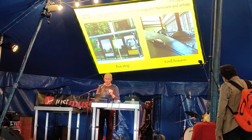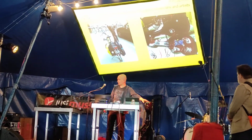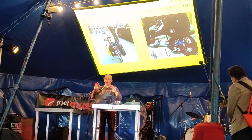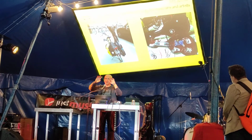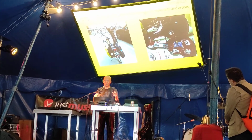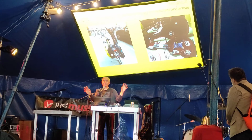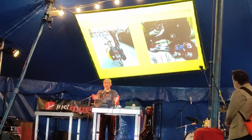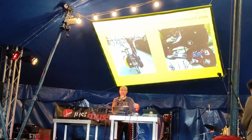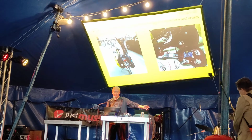Okay, and the second solution I came up with, that's this guitar case here. So I decided to turn spatialization inside out, basically. So instead of having a multitude of speakers around you that project inwards, I put, again, transducers inside the case, and now the case projects outwards, but in a multi-channel way, using the different surfaces of the guitar case to direct the sound, and also filter it, because up here you don't get much of a bass response.